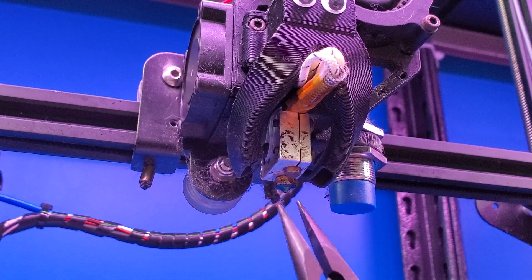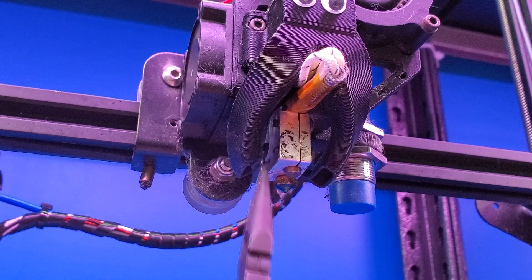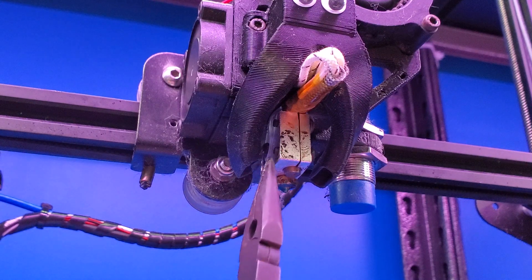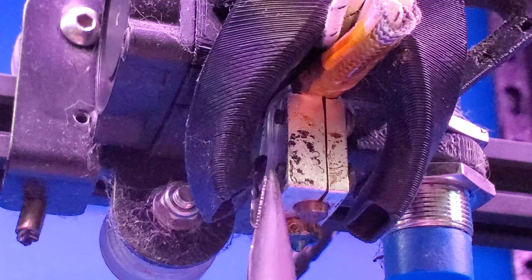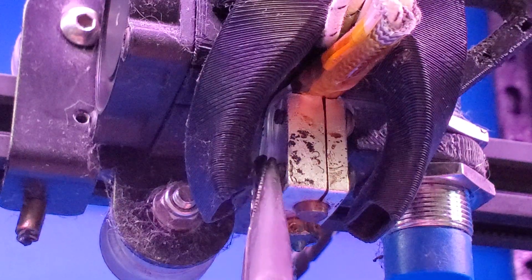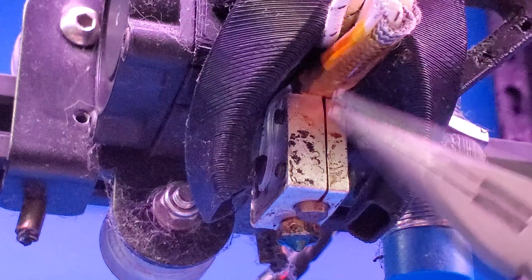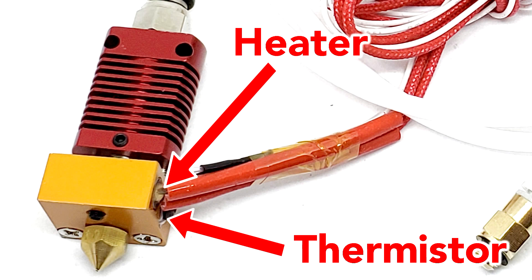On this machine, I do not have those screws in place, so there are a couple of things we need to do. We have to be mindful of our thermistors. On this particular block, the thermistor is on the left-hand side — you can identify it by the little leads right here. Your hot ends are usually set up with a retaining screw and PTFE-lined wires going down to the thermistor. We want to make sure we do not hit these with our pliers. In addition to the thermistor lines, we have our heater lines, and you've got to make sure you don't hit either set of wires because this has to be done while it's hot.